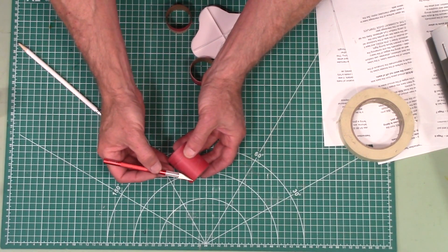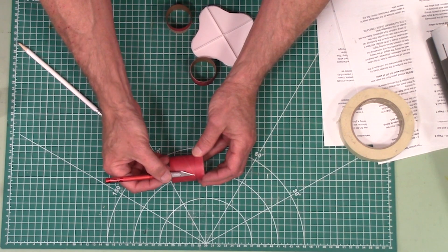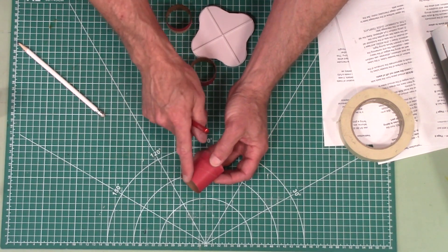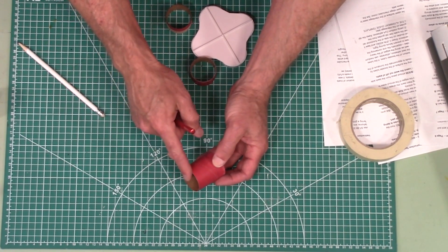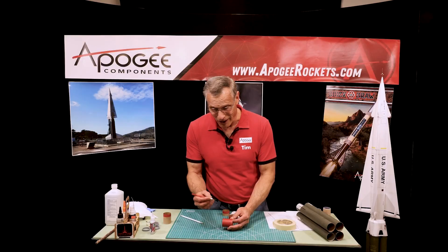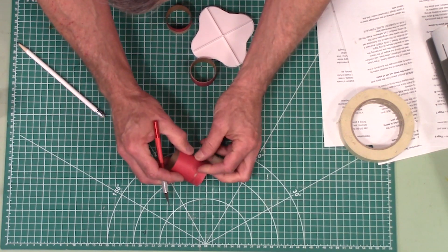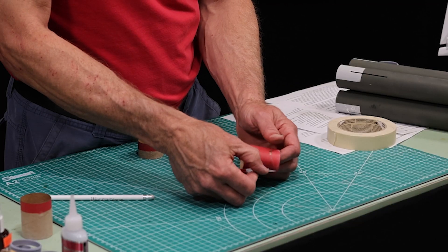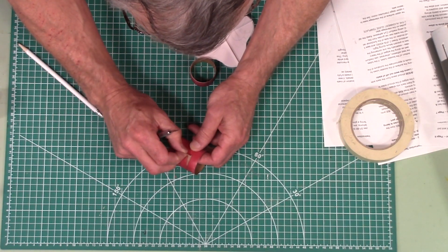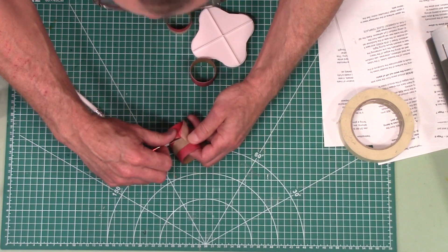What you're thinking is, I'll start from the edge right here where it's overlapped and just peel this way. I've found it's actually easier to pull it off right from where that cut line you made. The reason is because when the manufacturer makes them, it kind of rolls that edge and really pushes that red paper against the brown paper. But here we have a nice fresh cut line, so it's actually a little bit easier to remove. It's still hard and it's still going to take you some time, but get underneath it, find that edge, and lift it up. If it doesn't come up all the way, you're going to have to sand it off.